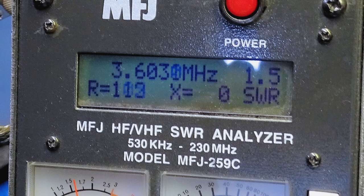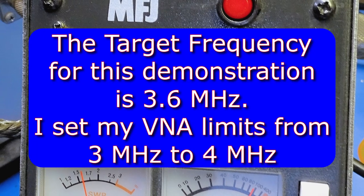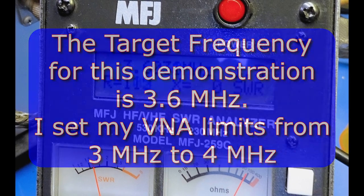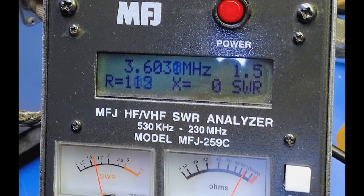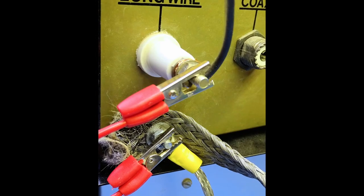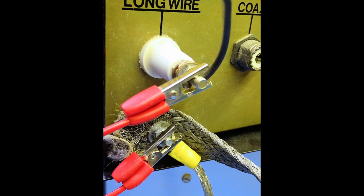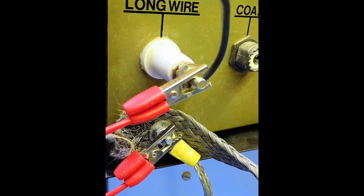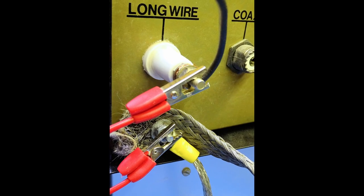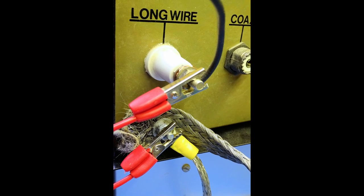Next, we have to set up our measurement instrument. If you're using an antenna analyzer, set it to the desired frequency. If you're using a VNA, set the frequency limits to include the target frequency and calibrate the VNA at the end of the cable you're going to use to connect to the antenna tuner. Before you do anything else, short the antenna or antenna system to ground to discharge any static buildup that may exist — this is to prevent a static discharge from damaging the front end of your analyzer or VNA. Then remove the short and connect the antenna or antenna system to the antenna tuner's antenna connection.